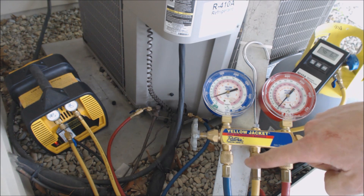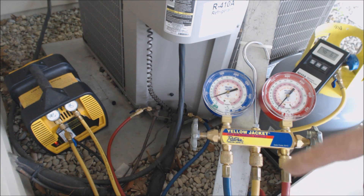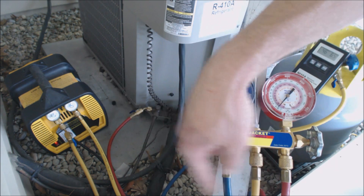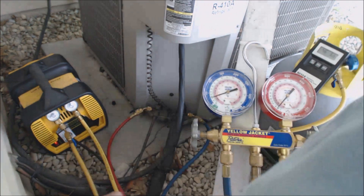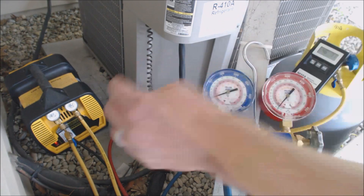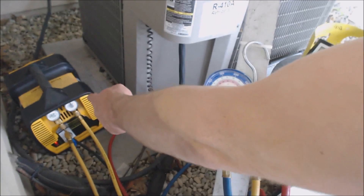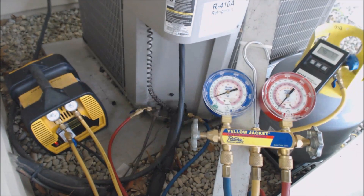What we have here is the yellow service hose — it goes from the gauge manifold, goes through a filter dryer, then to a second hose, and then to the inlet which is located right here. Then where it comes out, it comes through this hose right here and goes to the tank. The gauge on the left is where it's sucking in, and the gauge on the right shows the pressure while it's pumping into this tank.